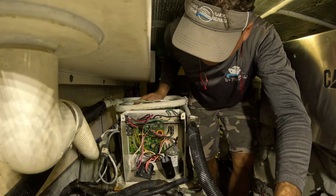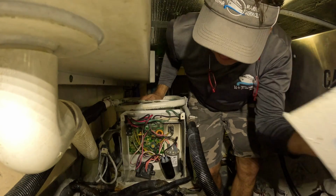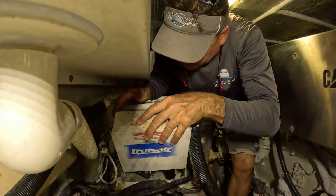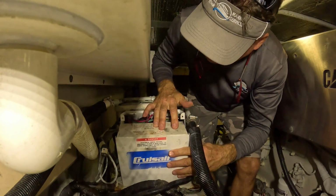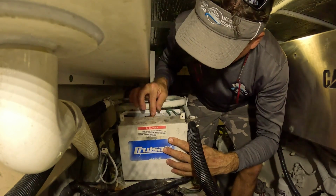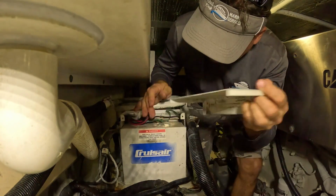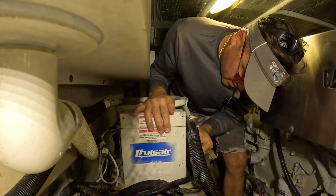Well, that's not good news. The compressor's locked up, the rotor won't rotate, and when it tries to, it's drawing a ton of amps, about 40 amps. Just way too many. So the last-ditch effort we could do is try a test set that I have that can actually run the compressor in reverse and see if we can get it to go. They made these old units difficult to deal with. There we go. So I will text the client and see what he wants to do.